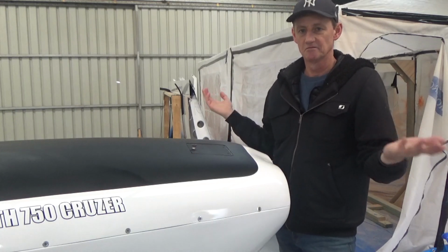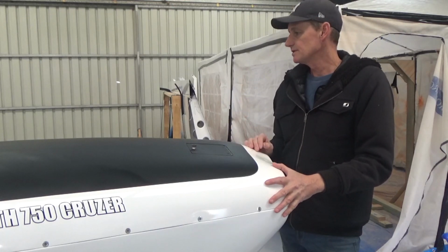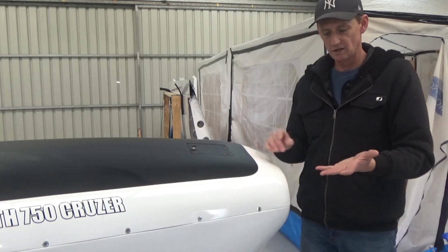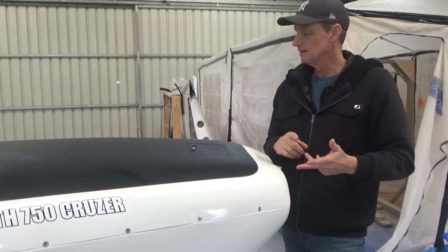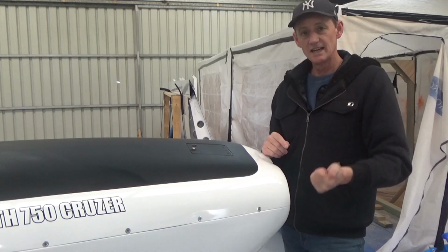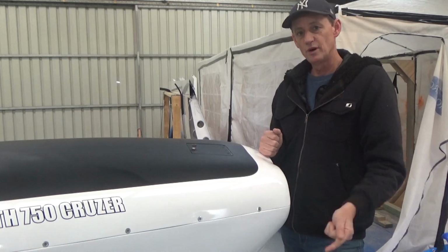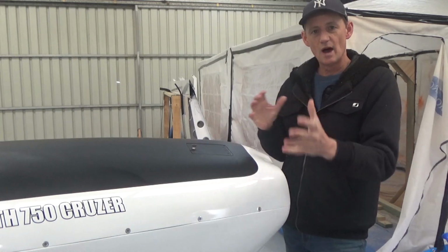It's going to start. It's a Jabiru engine straight from the factory. I've hooked up all the systems. I've checked during my installation, if you like. So I've checked the 6 EGTs, I've checked the 6 CHTs, the throttle, choke, magnetos, RPM. What else is there? Oil temp, oil pressure. All that's been checked with either a heat gun. There's other ways of doing it.